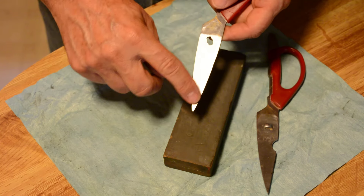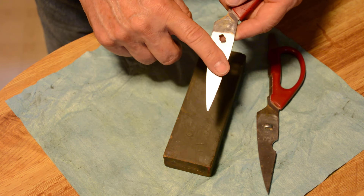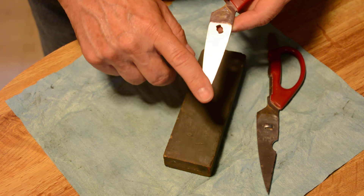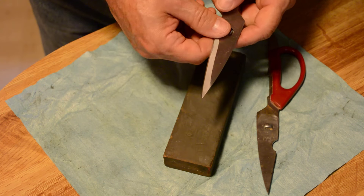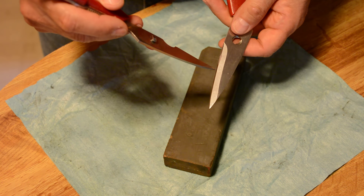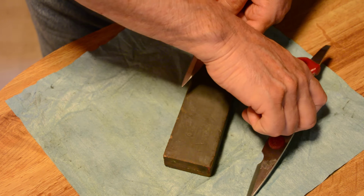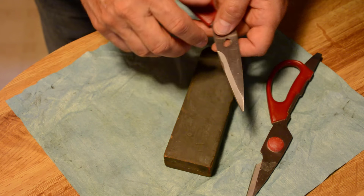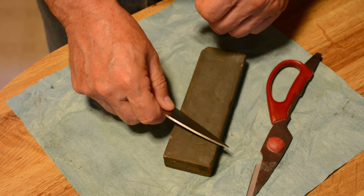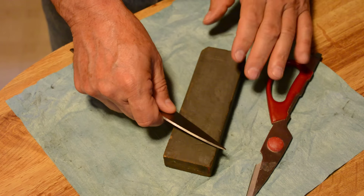Now, if you can see this flat side — it's completely flat, there's no bevel or anything on this side. Never sharpen that side of the scissors; you will ruin the shearing action and they will never cut good again. Now this side, if you look at it, this part out here is flat, but there's a bevel, and most of the time there's a second bevel out here which is your actual bevel to the edge of the shear. That's the bevel you want to match on your stone when you're sharpening. Turn that bevel down to the stone, and just rock it back and forth a little bit until you can feel that bevel flat against the stone. That's the angle you want as you work your shear against the stone.